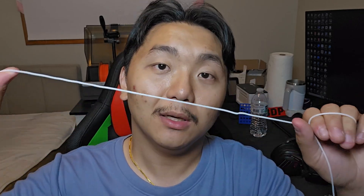I've been trying to do some projects with TPU for two days now and I cannot get it to print at all. Before this clog even happened, the Ace Pro cannot push TPU filament through — that little piece that comes out can't come out at all, it just comes out a little bit and goes back in because the Ace Pro cannot push TPU out. TPU is so flexible it doesn't have the strength to push that piece out the back of the Ace Pro. I heard people saying they can't even print with PETG because it just clogs. I tried ASA and it got clogged with a huge blob. But I'll definitely do more testing with more types of filament. ASA can't really be printed it seems — I'll try it again. TPU can't be printed. PETG maybe. But PLA works really great.